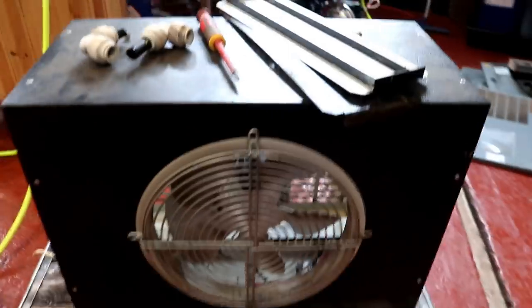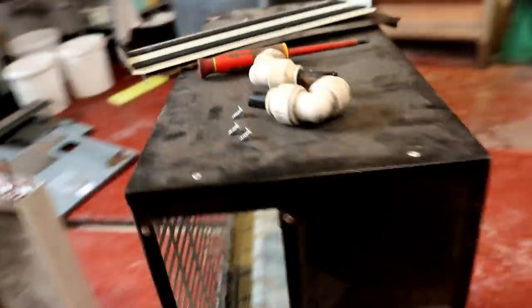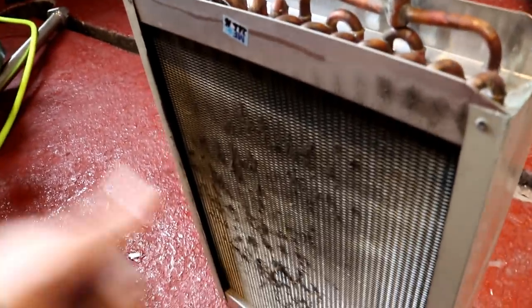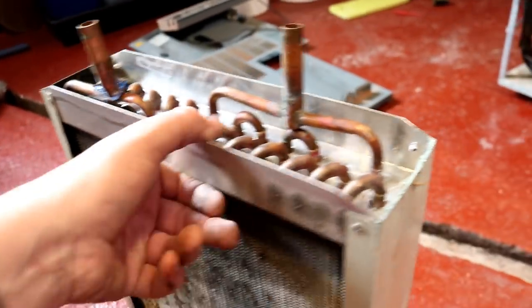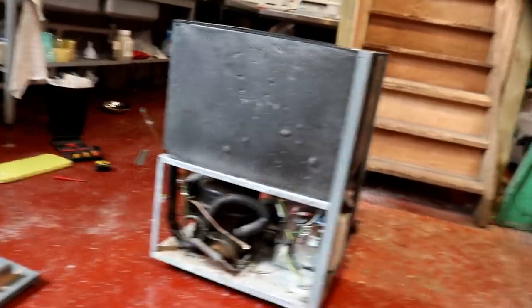Around the front we've got the glycol tank and the on/off switches. Over on the exchanger I've pulled it apart and the parts are dated 2016 inside, so this isn't a very old piece of kit at all. We've got a 24-volt fan which blows or draws air through a radiator panel — it's an MF 2016 unit. I'm just about to pop some water in here; if it's watertight then the heat exchanger is golden. All we have to do then is plug that bad boy in and, fingers crossed, clean all the panels and reassemble.